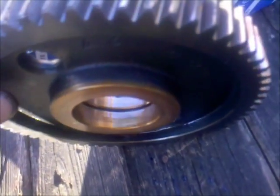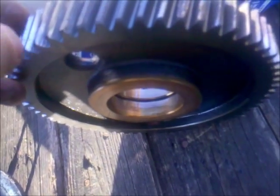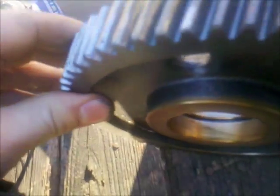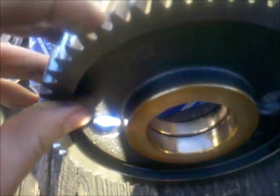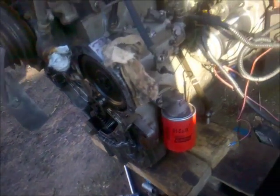Let's have a look at the idler gear. This is the idler gear bearing, and you can see it also broke one tooth off. I can see some periodic wear — we have wear here, and seven teeth later we have wear again on that tooth too — and that pattern continues over the whole gear. There was clearly an issue, but I don't know why or where it originated.